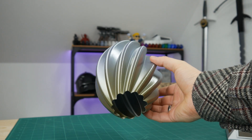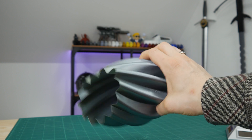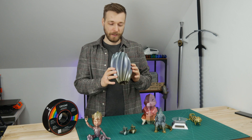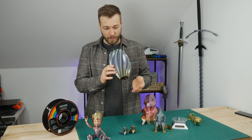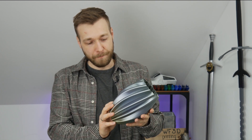The only issue was when removing it from the print bed, the bottom fell off. But I wouldn't count this directly to the filament, because it's just one outline, and my Prusa MK2S is running on its stock PEI sheet which I just replaced — so bed adhesion is quite good, which actually led to this failure. Overall, I really like the color gradient on this vase. The print came out really beautiful and I'm really happy with the result.